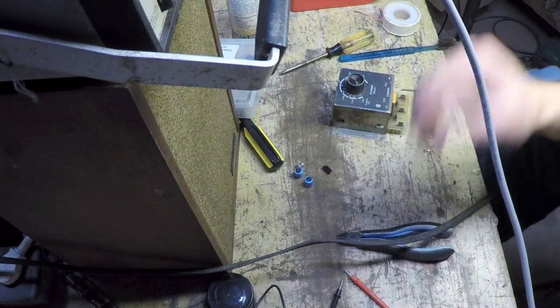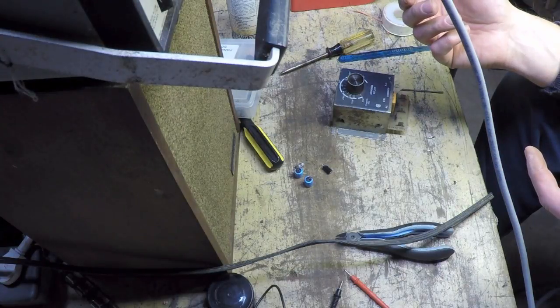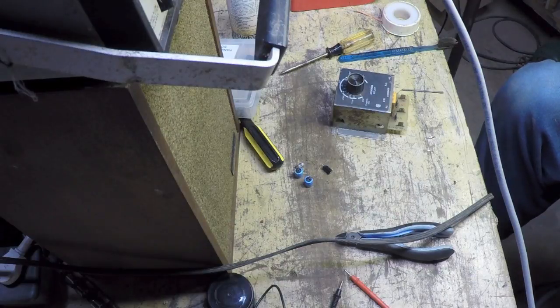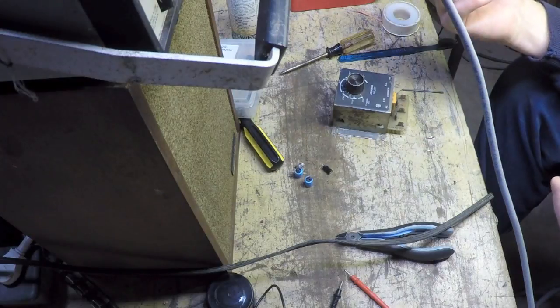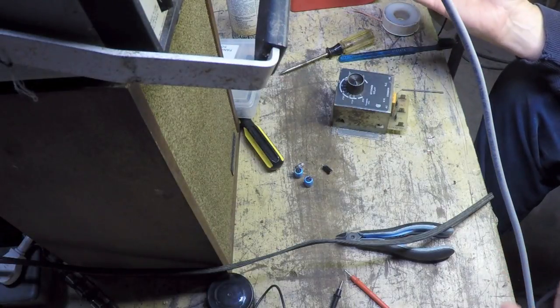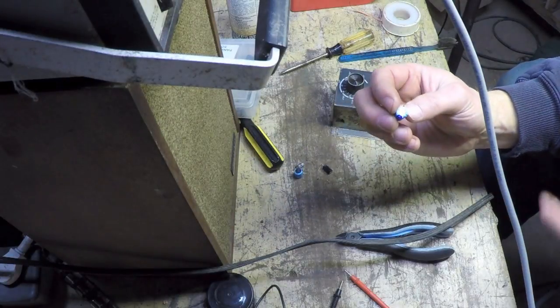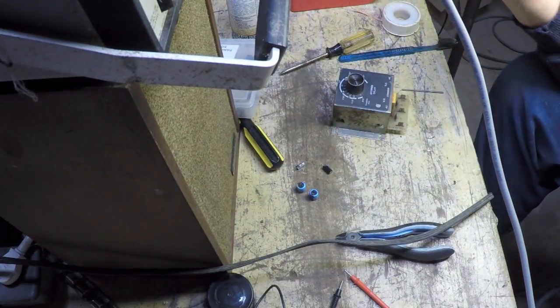That's not always the rule of thumb. For instance, I wouldn't want to use any caps out of switching power supplies for PCs, or especially anything on a PC motherboard. Although most of the caps on a PC motherboard are going to be lower voltage than 35 working volts, unless they're right up in the power sections. And the problem with the caps on most of those motherboards is I have a suspicion that their reliability is very minimal, because if you think about it, when they manufacture a typical motherboard, they're thinking that thing's going to be obsolete in a matter of years. I don't know if that's why the caps on motherboards in my experience are so crappy, but you tend to see a lot of electrolytics on motherboards where the tops have a dome shape, where they're popping out, and that's oftentimes a premonition of failure.